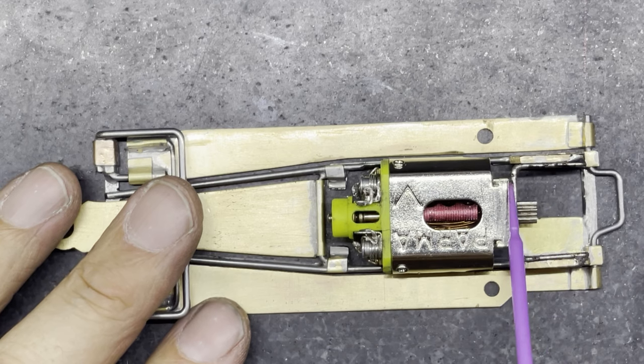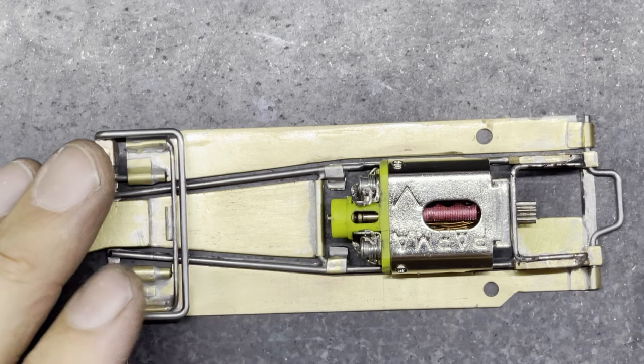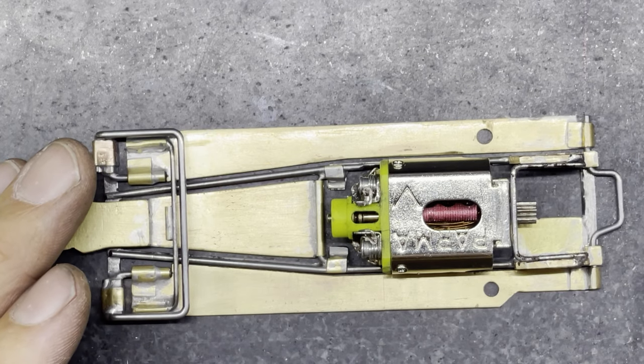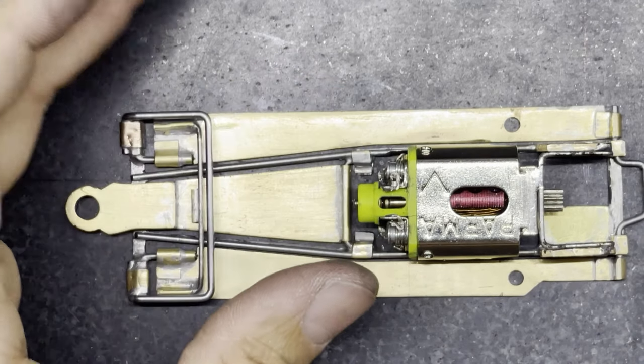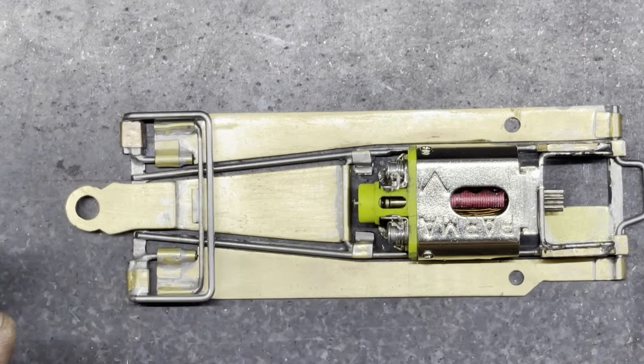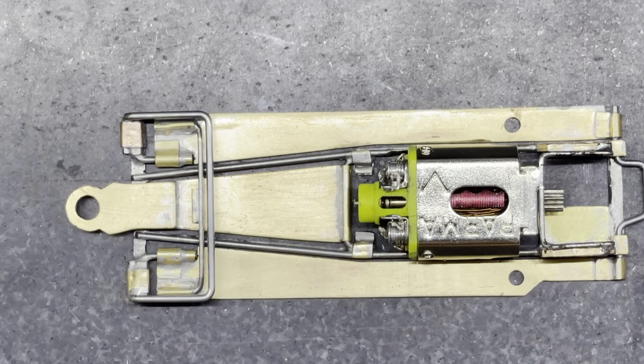And again there, I'm just going to tack the motor to the brace at the top here, just to hold it in two places, and then I'm going to test the gear mesh. There we go. So I've tacked that in. I'm just going to give that a little bit of a scrub just so the flux is not sitting on it for a long time while I'm testing the gear mesh, and I'll be back.